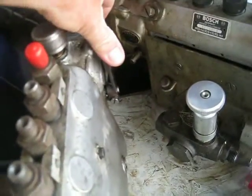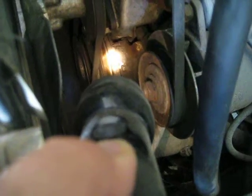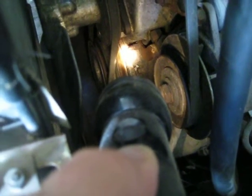I'm using this one because it moves all the way forward and all the way back — these other ones are jammed. Here's a 180D — you can't even see anything. Oh, here's one. Can you see that little arrow down there? That arrow will point to a mark that's supposed to be 26 degrees. You really have to look for it, it's not easy. But that arrow points to a mark — 10, 20, 30, 40 — and then position that to what looks like 26 degrees, and then the engine's timed for that diesel pump.